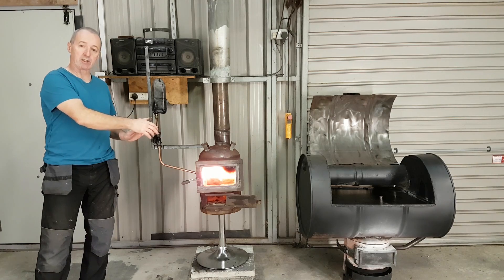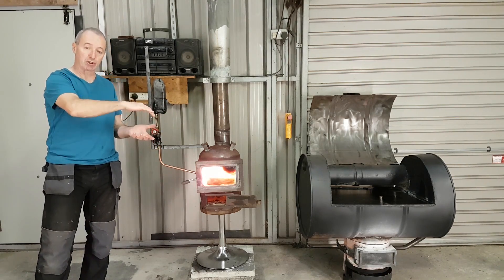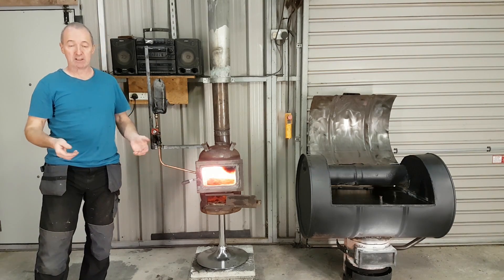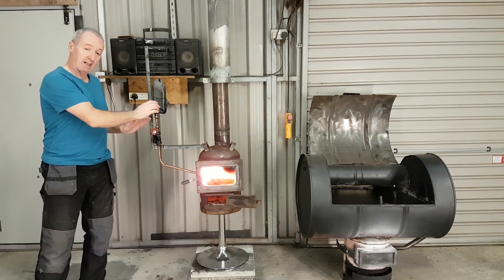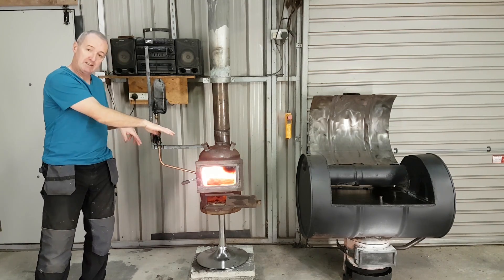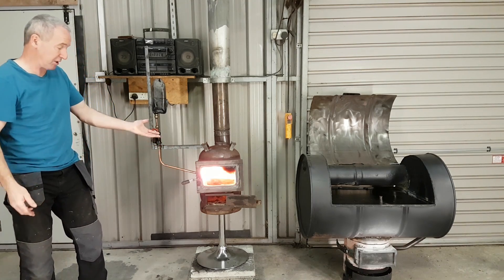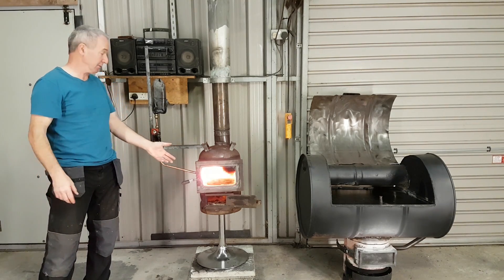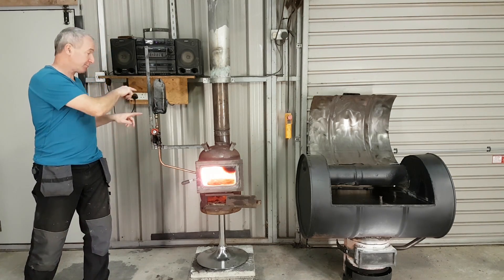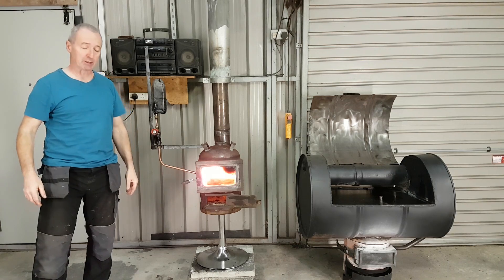So there you have it — another waste oil burner. I had this working kind of uncontrolled before: I put waste oil in a tray and just shoved it into the bottom door, and it worked great but wasn't controllable. So now we have it controllable — we introduce the fuel down through this metering valve and then down into it. It's been going for about 25–30 minutes now and it's used about this much oil. In its current configuration it's burning about 2 litres per hour — that's about half a US gallon.